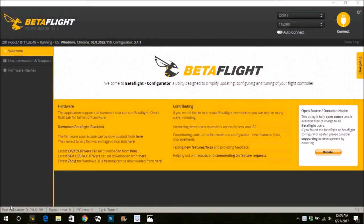Once your receiver is soldered to the flight controller, you need to set it up in Betaflight and bind it to your controller. The SPM 4648 is auto-bind — it automatically goes into bind mode if it doesn't have a connection, so you plug in power, watch the receiver light flash, and bind your radio. The SPM 4649T telemetry receiver has a bind plug in the wiring harness — put the plug in, power it up, bind the radio, power everything down, remove the bind plug, and it should be bound.